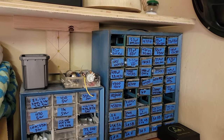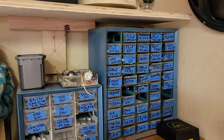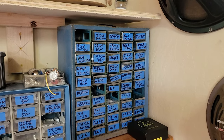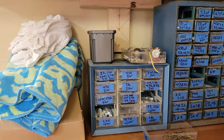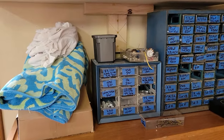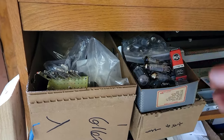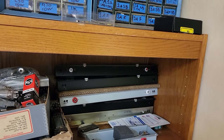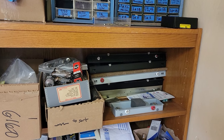All my small electrolytic caps, all your solid-state values including some bigger values — kind of uncommon, like snap-can size. Some transistors, all of my fuses, specialty stuff, zener diodes. Got a bunch of Hot Rod fuses because you always need to replace those. Big resistors — your 5-watt, 10-watt, probably have too many 10-watts but whatever, they're not going bad sitting there. Weirdo tubes, cool RCA box, lots of random stuff. Test reverb tanks for Hot Rod Deluxe, Fenders, or other solid-state things — always good to have a bunch of test tanks so you can check if you're not getting reverb just from the tank. Makes it really easy to swap in.